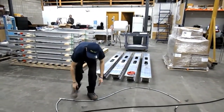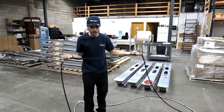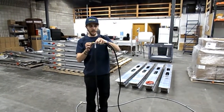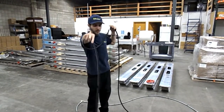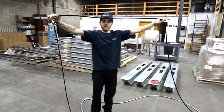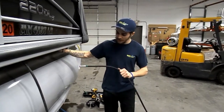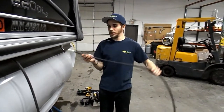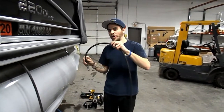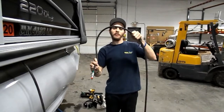With the front it's a little different because we have an enclosed ski compartment, so we have to make a much longer T and make our split a little different - I'm starting it a little earlier. We're still going to connect green-blue here, this is going to run down to the bottom part of my cylinder and this will run across the boat down to the other one. I've got my other guy underneath the boat - he's going to be holding his hand up through the hole trying to catch my hose, then we'll run our crossover along. He'll grab that one too and pull them down into those holes. We'll leave them hanging down about a foot, foot and a half - when we throw our legs up, we'll just shove them down there and deal with them later.